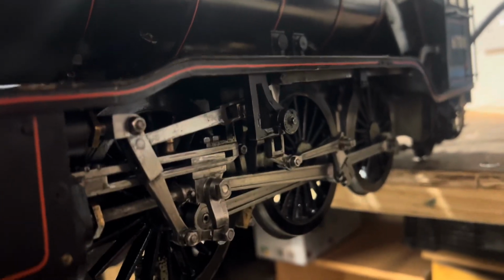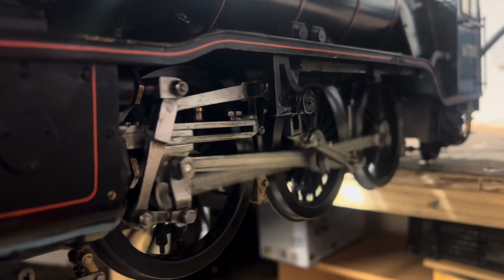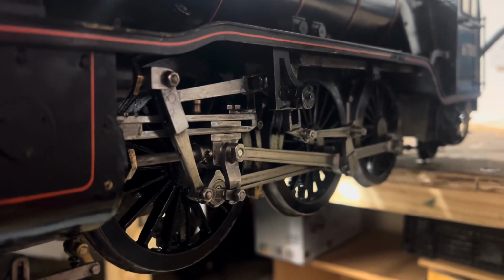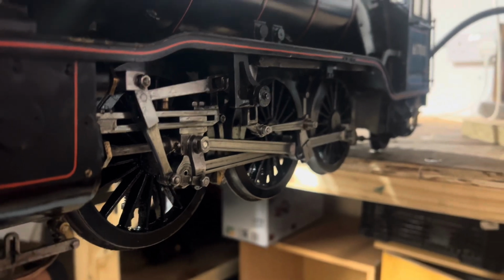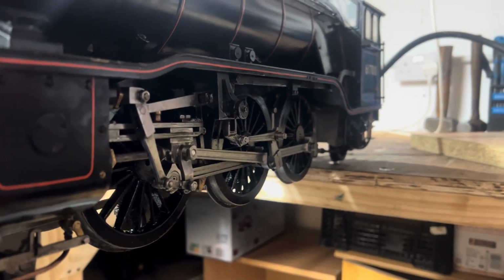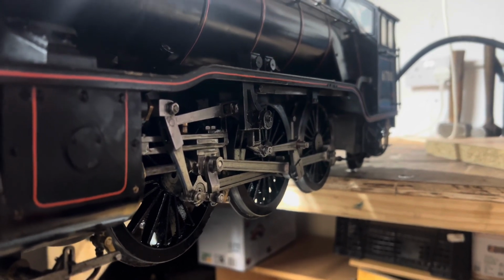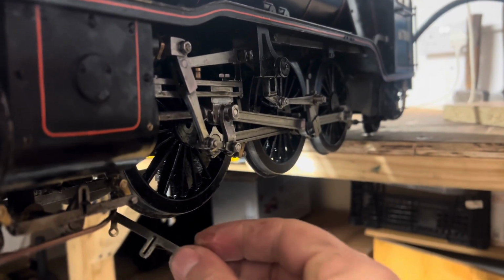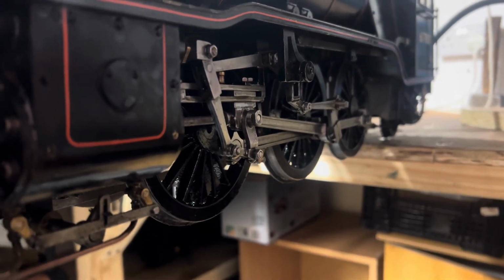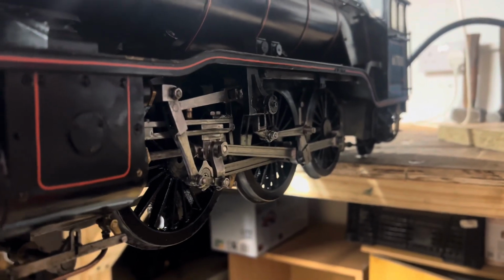Right, I've repacked it. I'm just going to give her a flick because this compressor can't really keep up with it. Much better. So the remaining clanking is in the boxes. At some point, she will need new boxes. But that's enough for now. The only real annoying thing left to fix is the drain cock linkage on the other side. The glands could do a bit more packing in them, but they'll only run in and pack down more.